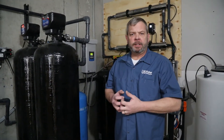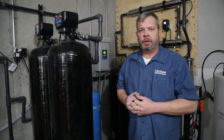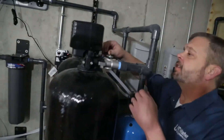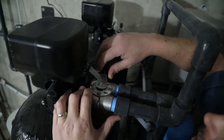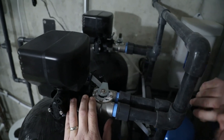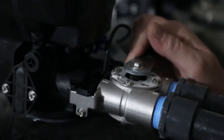Once we've set the peroxide injection system to 60 seconds, 100 percent, we're going to go ahead and turn the water on to the system and make sure we don't have any leaks. Before we turn the water on, we're going to make sure our carbon filters are in bypass mode. You can see there is actually an arrow on here that will tell you bypass or service. When they're in bypass, the handle will bisect the plumbing. Once we've confirmed we have the unit in bypass, we can go ahead and turn the water on.